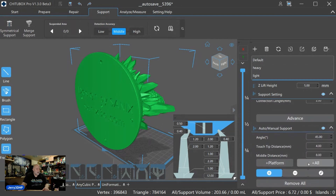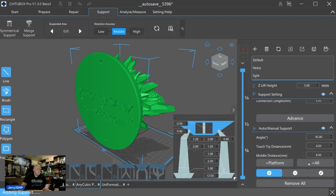With resin printers it doesn't matter if you have one part or 10 parts on the bed — it prints by layer. So it doesn't matter if you have one tall object or 20 tall objects, they'll all finish in the same amount of time. We'll come over here and hit Add All. You can add supports manually, but auto supports usually work great for me. You can pick heavy, light, or medium density, adjust the tip types, angles, and thickness — it can all be adjusted in here.